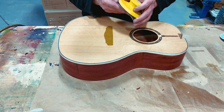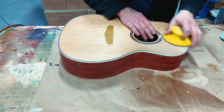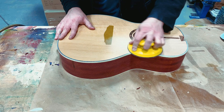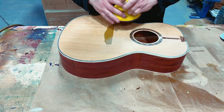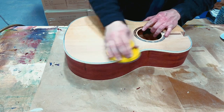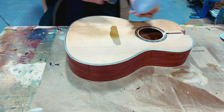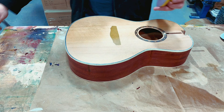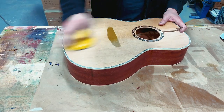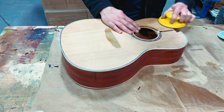When you've finished letting it dry, here's what it'll look like, and you can come back in and sand it. I've got some 800 grit here, which I'm using because I'm going over this with transparent lacquer — so I'm not priming. I may actually sand this again quickly with 400 grit once I decide exactly what I'm doing. I don't really need a bunch of sealer since the grain is filled so smoothly. You can see that kind of white powder as opposed to a wood grain powder — that's because of how well sealed this is. Mirka has a micromesh paper that doesn't clog up like a lot of sanding paper does, and I like using that for this sort of thing. I have a link to that in the Amazon link in the description.